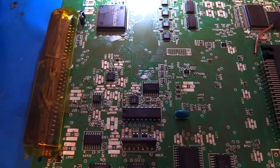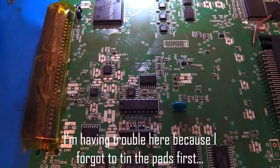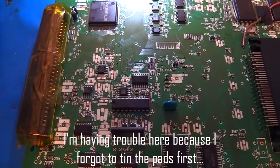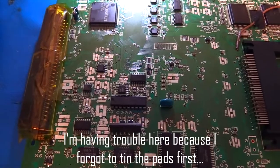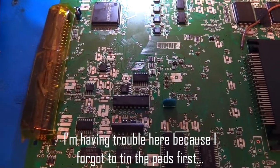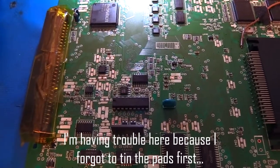I've read a lot of pros and cons. I know some other modders and repair people swear by, especially the ceramic caps. My take on it personally is, if ceramic caps were the right ones to use in the design, that's what they would have used in the first place. The electrolytic caps also handle ripple better.